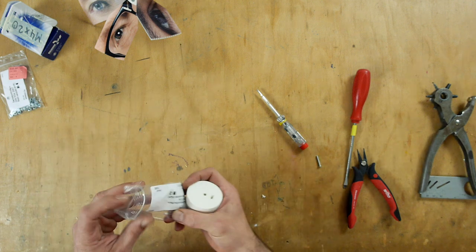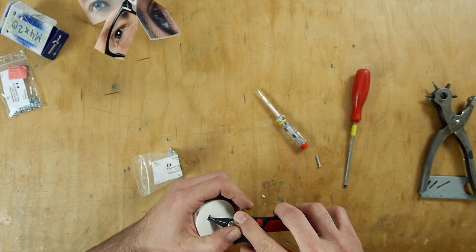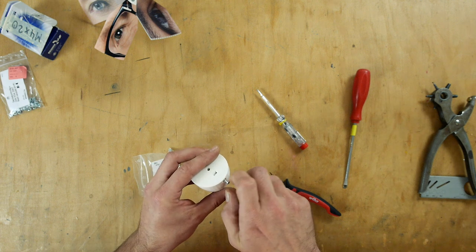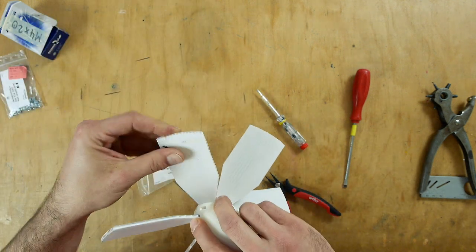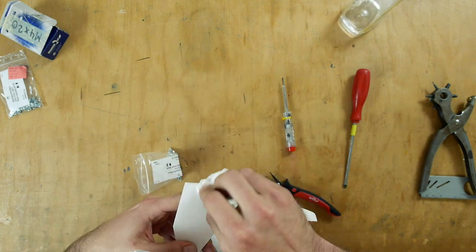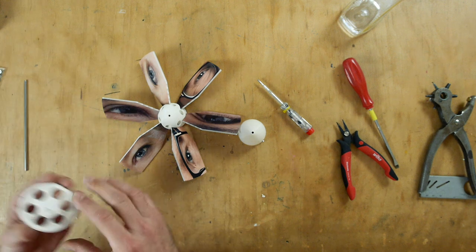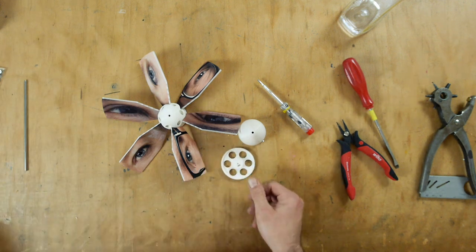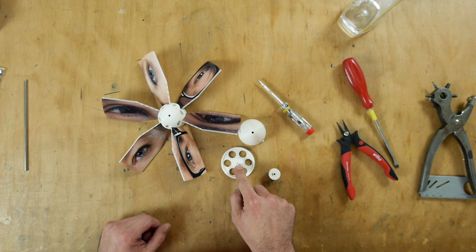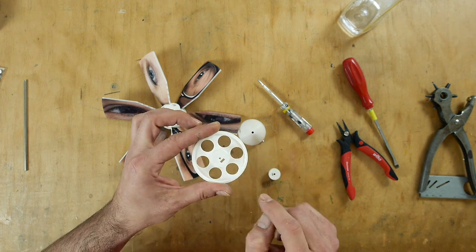We also put in a set screw. This goes then here behind. I will get rid of the dirt here. Rotor is finished. Now, what else do we need? We need another set screw for this here, another set screw for that here. We can actually do this right away. But here, I also think that I have to open this a little bit up with a 2.5 mm drill.